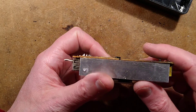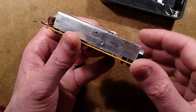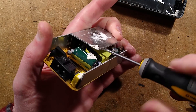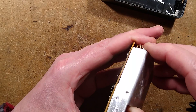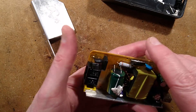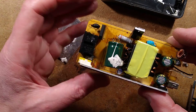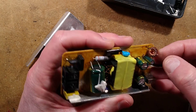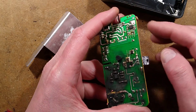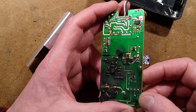How annoying — what a terrible thing. One oversight. This is because they needed a big heatsink in a plastic enclosure to dissipate heat from the transistor. It's taken quite a divot out — that would have been quite a flash. The transformer has been absolutely fine. It is just that poor placement of components with the low-voltage side next to the high-voltage side. That heatsink could have been put onto an isolated pad, but they've actually connected it onto what appears to be the ground for what's left of that circuitry. The negative of that big fat capacitor is connected to that, and that is what initiated the fault — that bridge from the input side to the output side.